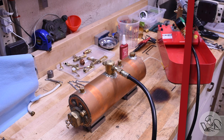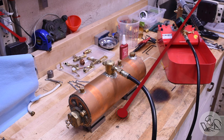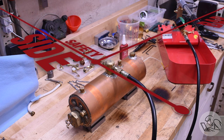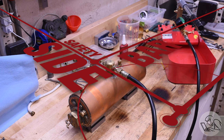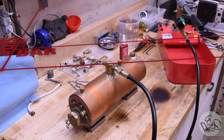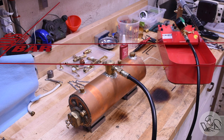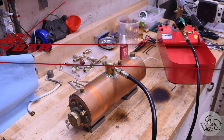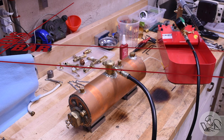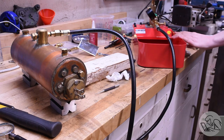Safety sidebar: if you're building a new boiler there's a very important test to do on the safety valve. You need to do a full steam test with the boiler fired until the safety valve goes off, and you need to see that the safety valve can evacuate steam faster than the heat source is building that steam. If not, the boiler is going to over-pressure — the safety valve has to be able to overpower the heat source. I've already done that test on this boiler, and because it's electric you can kill the heat source instantly, so it's less of a concern than, say, a model locomotive with a coal fire — there's no way to instantly shut off a coal fire, which is why locomotives typically have a way to drop the fire right out of the bottom of the engine in just such an emergency.